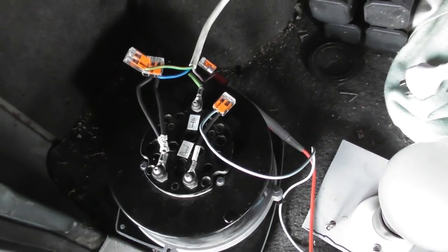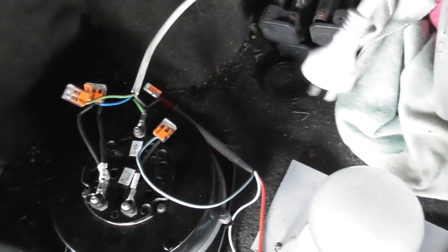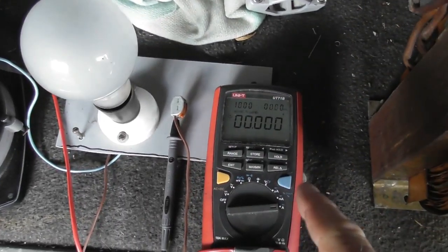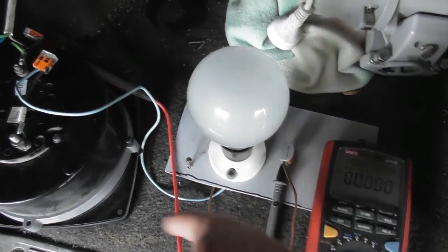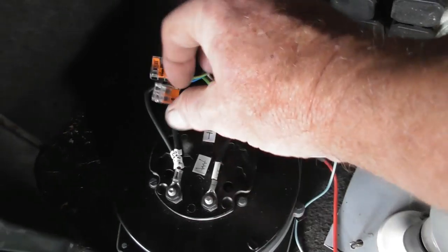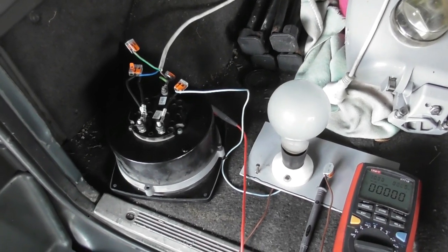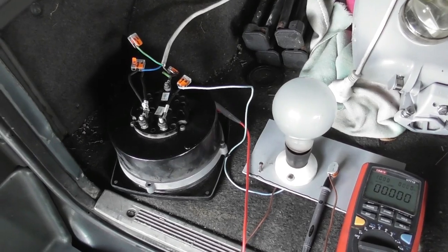So to test this meter, I think it's a 1 amp meter, I wired it up to a normal plug lead. Active comes in, goes through the probe into the multimeter, out of the multimeter to a 200 watt globe, out of the lamp to a connector in the ammeter, and return path out of the ammeter. So we're going to energize this at 230, 240 volts, probably about 0.8, 0.9 ampere.